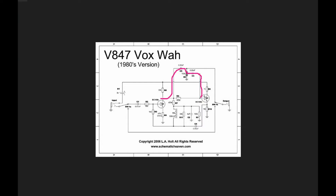Up to this point we haven't talked about some of the components yet. These components, along with this inductor, are going to form the resonant behavior of our circuit. You'll notice that there isn't any kind of resistor biasing our base in the normal way. The bias for our base is actually being provided through this 1.5k resistor and the parallel combination of the inductor and capacitor.